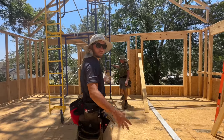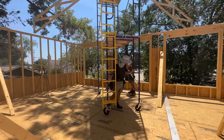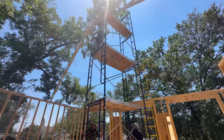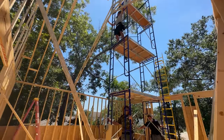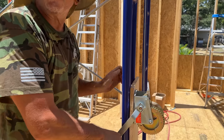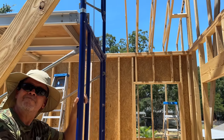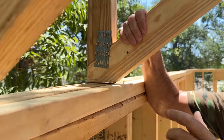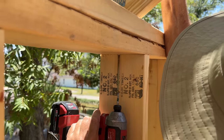And now we're gonna unlock the wheels and roll the truss into place. Now we're gonna lower the hoist and set the truss on our marks on the top plate. You ready, Rad? Yes, sir. Whenever you're ready. All right, guys, I'm on layout. I'm flush with the outside of our top plates, and I got a 6-inch screw already started right here. I'm gonna drive it home.